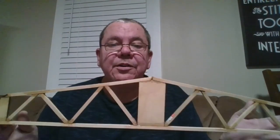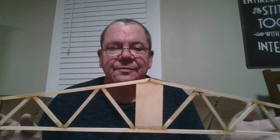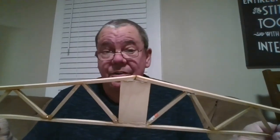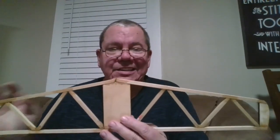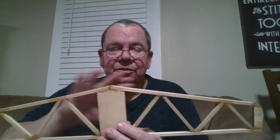Now, I've got an X-Tool D1 laser, which is wonderful for cutting out bulkheads and different pieces for an airplane. I wanted to be able to do this hand assembly stuff a lot quicker. And by the way, this piece here took about 30 minutes. What I did was I made a jig in Lightburn to do this up.